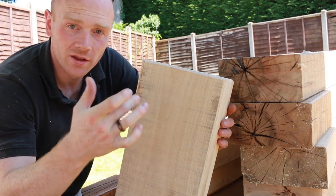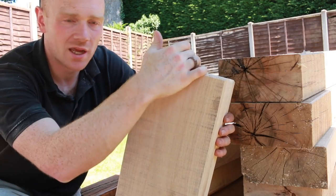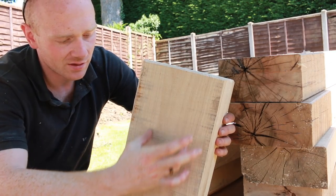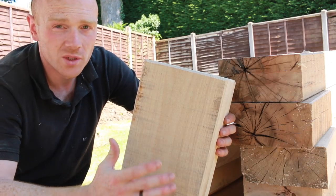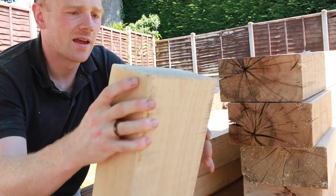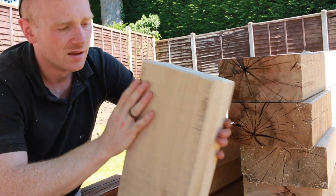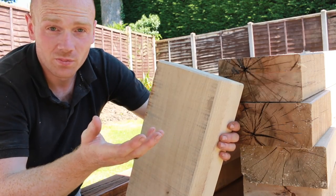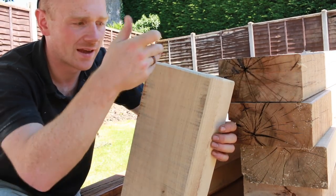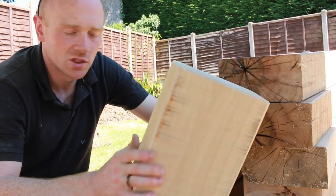You need to be aware that this is freshly cut, full of moisture — it will shrink, crack, and check. Those characteristic cracks that run down the length of the grain will appear on the majority; sometimes very small, sometimes they'll open right up. On the end grain, if you're using them vertically, you'll get some checking there too. But overall that's part of the charm of oak — water can get into those cracks but will usually find its way out and doesn't really cause too much of an issue.